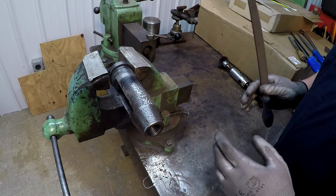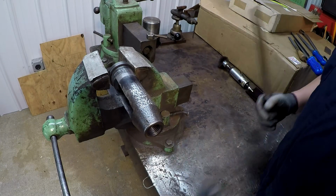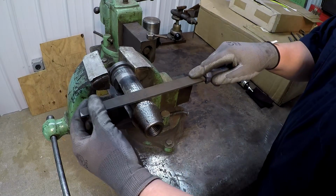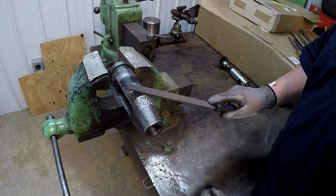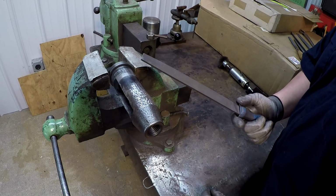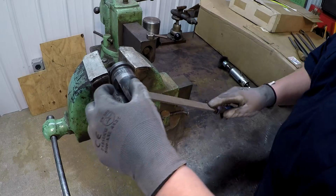that's how you're supposed to use a file, is a forward cut. All right, but when you're filing, not every time are you wanting to pick up and bring back. You want to keep the file flat on the surface that you're filing and bring it back. That little bit of dragging that you're doing on that backstroke right there is not damaging that file. I don't care what you have to say about that. Now, if I'm pushing hard and dragging it back, you might start dulling that cutting edge. But when you're filing,